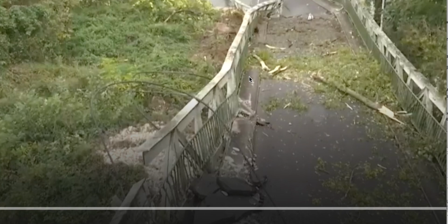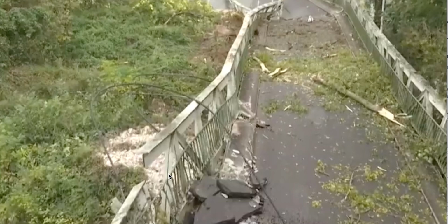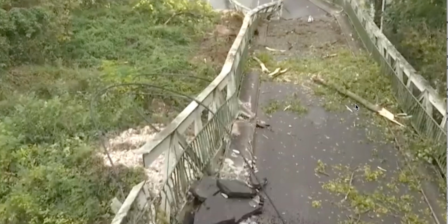And it switched over to this side, the cable's hanging, holding the bridge. But at one point, this end came down and hit first. This left side here hit first. So I wonder if the bridge had like a wave going on when it failed, when it popped. Because this hit first, this last part would then be what, just a cantilever that couldn't take the sudden stop, and it just whacked itself apart. I mean, right here, it sheared. I don't know what word to use. It brittly fractured itself apart. There's an invisible force there that just cleaned it right up.